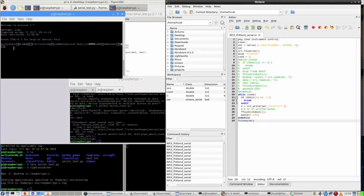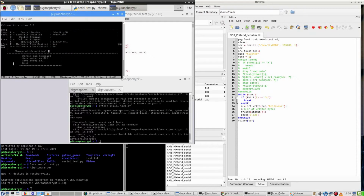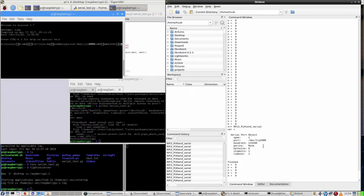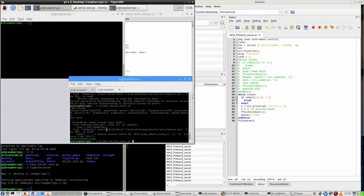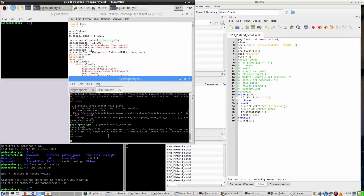Unfortunately, I should have had hellos below each other. The point is here, it is the very correct idea, except for this one. So, is this better? Because this is an indication for a bad speed setting, and unfortunately it goes on the same way. 9 bytes sent, but I get no hello. So when I break this off and I start the Python, which only reads, then it doesn't receive anything.